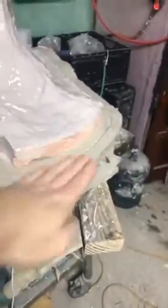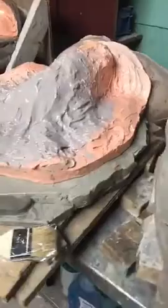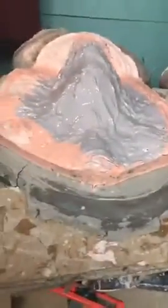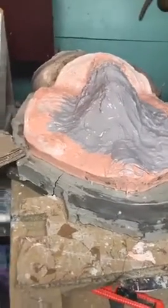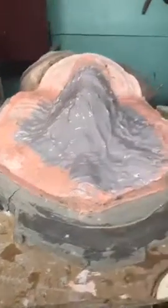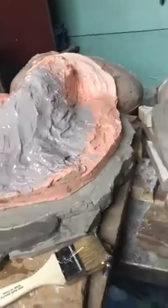And we're going to come back and do another bit of it as soon as I finish the mold wall. So Bondo will come down around and cover this whole mold wall. So I have a real pretty seam, which will also help reduce the amount of fiberglass splinters that I would ever get from using the mold. I need more. The Bondo resin mix will bond to itself, so the fact that I only did part of this one won't matter at all. And so now I'm gonna go work on my mold wall, finish mold wall, and do that part.